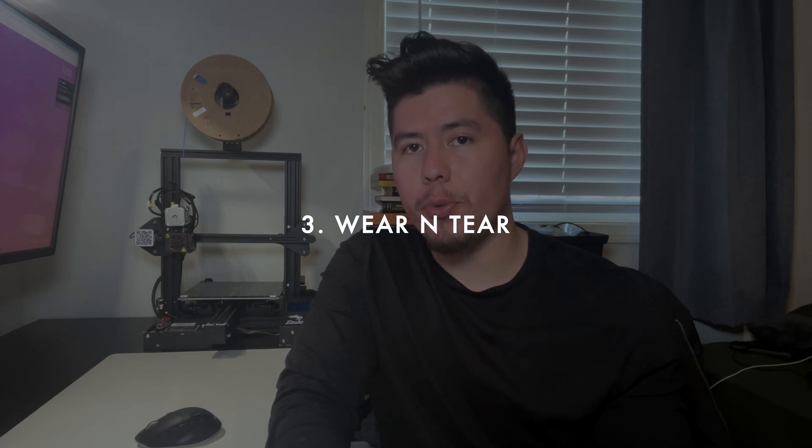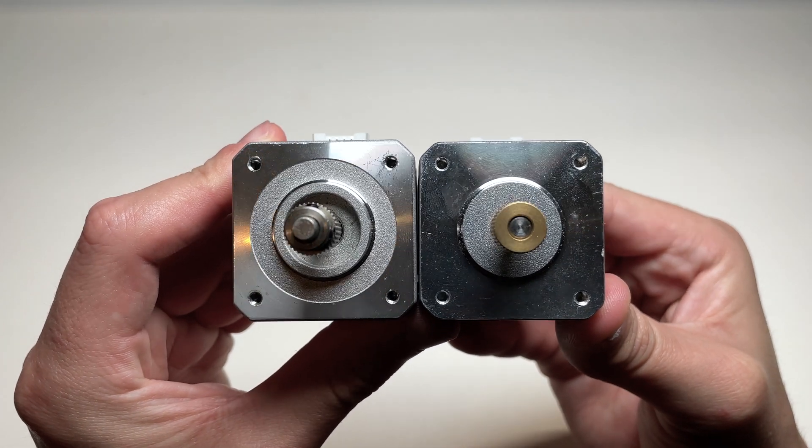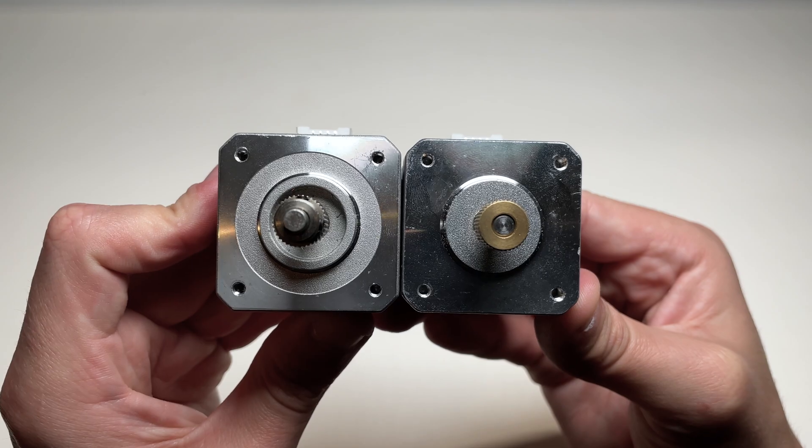The third culprit is the amount of retractions and movements that your gear has to go through while actually printing. Think about how often and how frequently your gear is pushing filament through a hot end — it not only has to push filament through a tube, but also push it with enough pressure to go through a hot end and out through a hot nozzle. Additionally, all the retractions and movements made during the duration of the print will also increase wear on the gear itself. Think of your extruder gear like a car tire — the more you drive, the more likely the tread is to wear out over time. This is nobody's fault, as it's simply what the printer is designed to do.